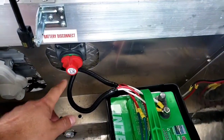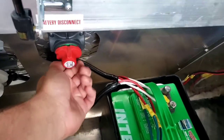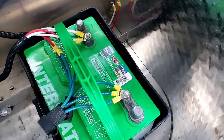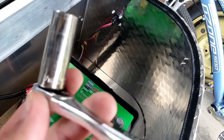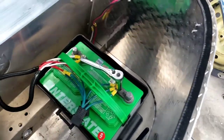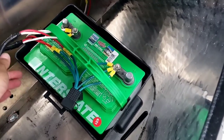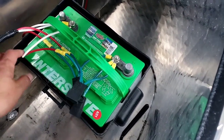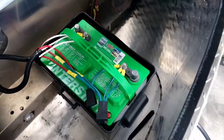The next thing you want to do is make sure your switch is in the off position — the little notch indicates off. If you turn it, it's on; turn it back to make sure it's off. Next, disconnect everything connected to the battery before you start working on it. It takes a 9/16 socket. Before you take everything off, it might be a good idea to take a picture so you can consult it when you're done. On this tag the green wires go to positive and white go to negative, but snap a picture anyway.